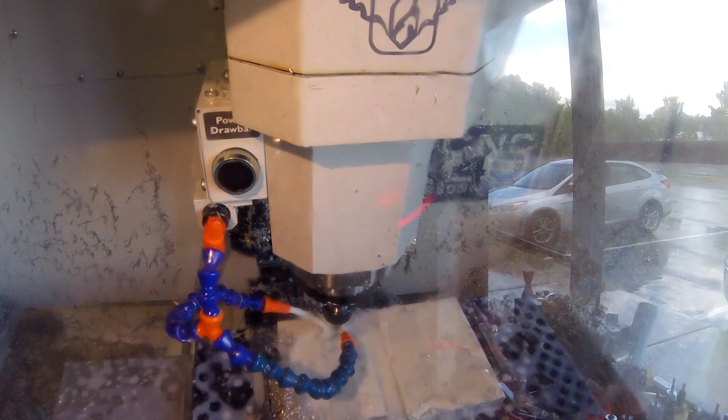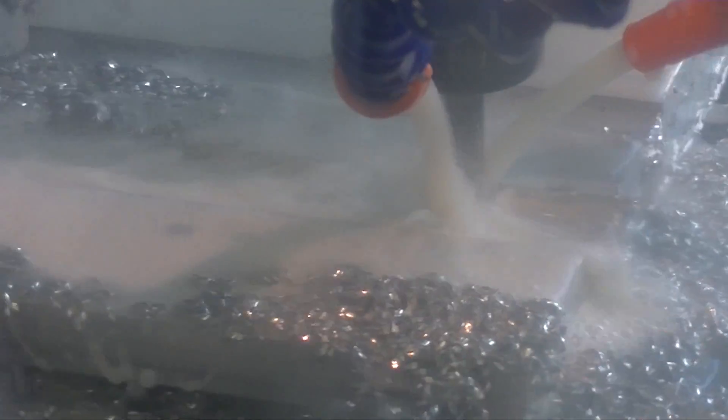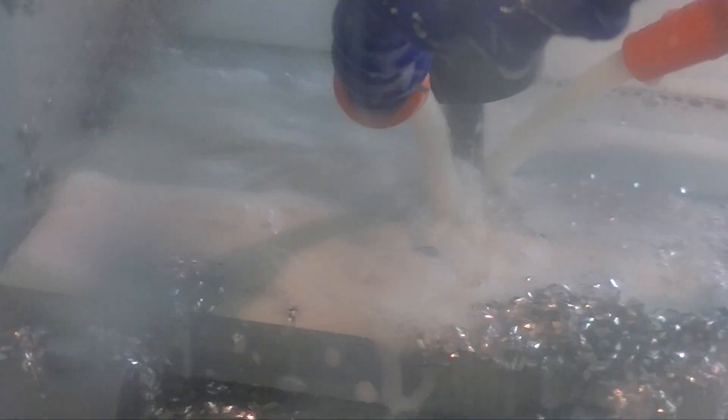While we're here, let's talk about something — you'll see the action stop a lot. You see all those chips back there? I'm actually running into issues with chip compaction, especially during these longer operations. The chips end up on the rear side of the Y-axis way covers and they end up packing over time, impeding motion. It's actually gotten to a point where it has destroyed my Y-axis way cover back there — it would lose its position and throw an error. So I had to clean out the way covers and start over again, and that happened every few minutes once I hit this point.